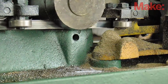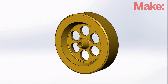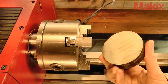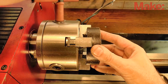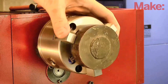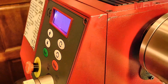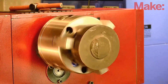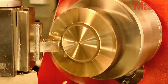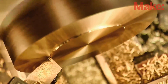So with our stock prepared, let's get started. The first part we're going to make is the flywheel. Now the brass stock will have rough edges at this point from the saw cut, and we really need smooth surfaces for marking out, so it's going to need some facing cuts to clean it up. Using the outside jaws, secure the workpiece in the chuck and then face each side. As you face that second side, bring the workpiece to final thickness.